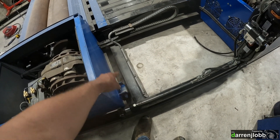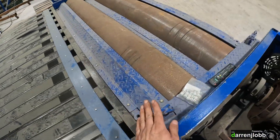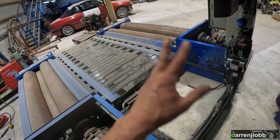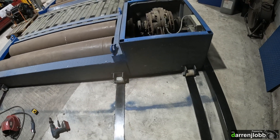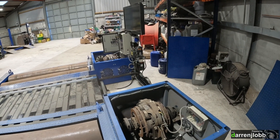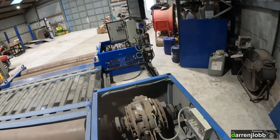I'm going to put a couple of eyes on both sides on that frame and on the floor on the other side. We've got hooks at all four corners of the dyno so you can use them to your advantage — for example, you can come in under the car and route through, using them at the back and front. Different cars call for different things, so just having lots of eyes and places you can tie to is really useful. Once that's completed there's a little bit of paint to put on. Then it's basically wiring up the control box, priming up the hydraulics, getting shop air across — Chris ran some copper pipe across and it's just isolated at the moment.